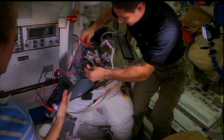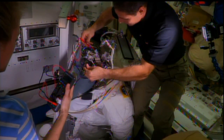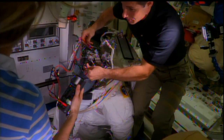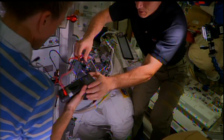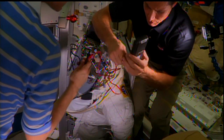The two astronauts are spending a lot of their day on this. The spacesuit is designed so that many different components can be removed and replaced. However, this specific component was not one that was necessarily trained on the ground. The astronauts get several high-intensity maintenance training sessions for generic training so they know how to use all the tools on the space station, but they never specifically trained on this unit. So we knew it was going to take them a little longer to get familiar with the fan pump water separator. There are several very small components, and we want to make sure we're very careful not to introduce any small components or pieces of debris into the suit, because that could be a hazardous situation if it got into any of our loops.